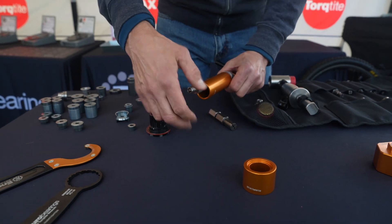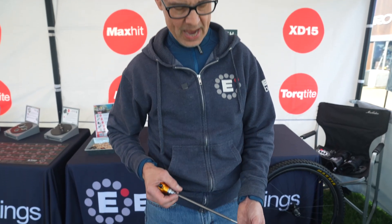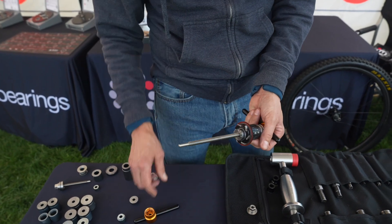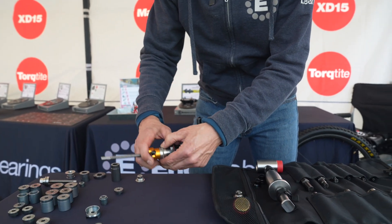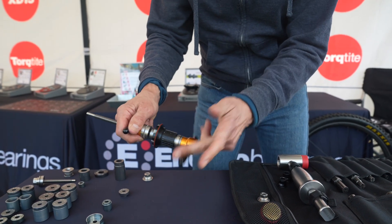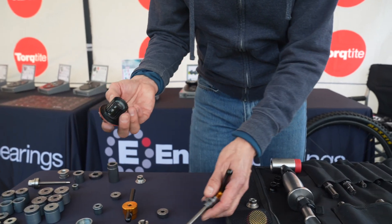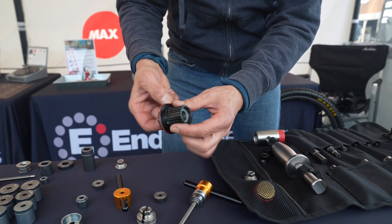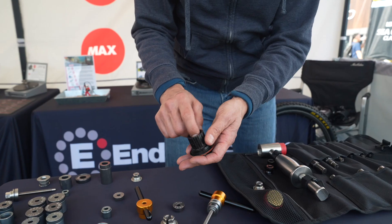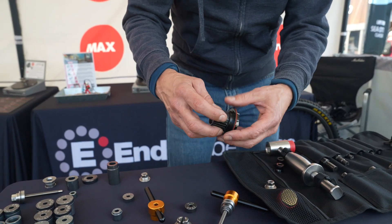Really what we've done is build these tools that provide different functionality for different purposes. Put that bearing back in using the standard bearing press — that's a 6802 bearing. So I'll get our inner guides on either side, get everything lined up real nice, slide that zip nut in place, handle number two, tighten it all down. It needs to just feel easy to do. You want to make it snug, but not overly tight. Because what can happen sometimes, if the tolerances aren't exactly right between the bearing bore and the spacer, it can be a little bit rough. If you feel that, just go through the process again and just barely loosen the bearing and everything will spin super nice.